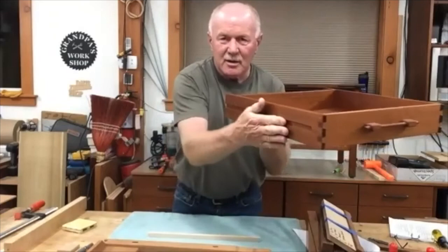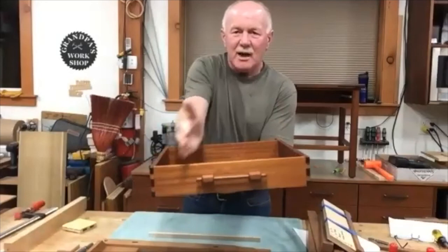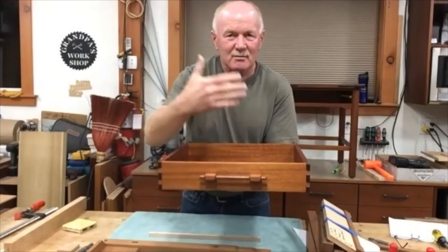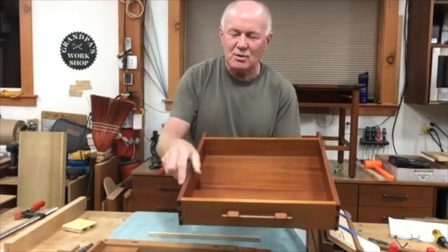Down there is where the drawer glide goes in. The upside to that particular application is that it's a drawer that's going to hold hanging files. Hanging files need a little metal rail to hang from. So that rabbet, that shelf, is the place where we put the notch to put the metal hanger rod, so it doesn't look bad. Got it. If this was going to be a clothing storage drawer, you're not going to have that. So at first glance, you would see the narrower side on the top, but you'd see the step down below.